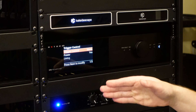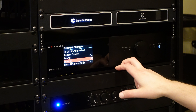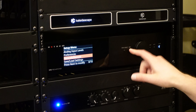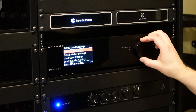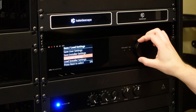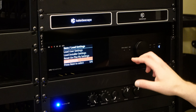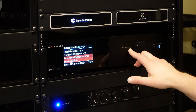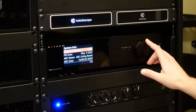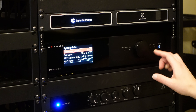You can also enable or disable the discrete IR. I am using the rear IR input for the IR repeater relay, but the front IR I have disabled. Save and load settings lets you save and recall two levels of settings — one called 'user' and one called 'installer.' I do save my settings in the user preset in case I need to restore them. There are options to load defaults and reset on-the-fly settings as well. Finally, system info shows the firmware version — 1.8.30 — your ARC upload information with name and date, and the MAC address of the unit.